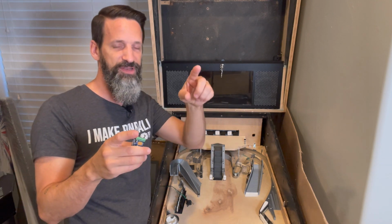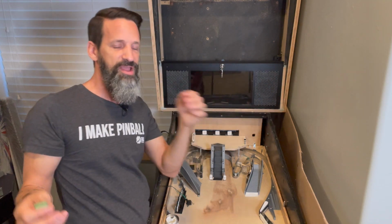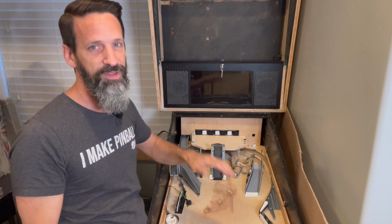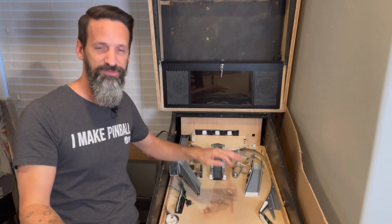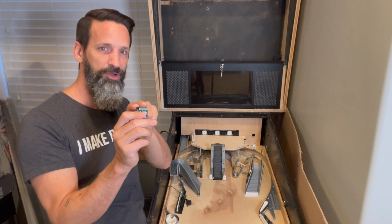If you happen to take, like, a red wire and the black wire and put those together in a coil, either it's not going to work at all or it's going to be really wonky, noticeably wrong, erratic behavior when you turn the stepper motor on, okay? So make sure you're getting the colors paired and into a coil, all right?